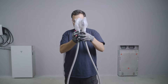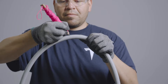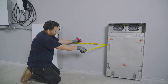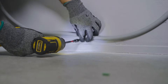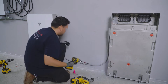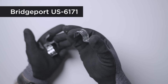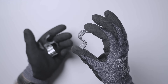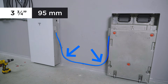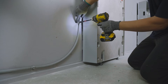For side-by-side mounting installations, make the most symmetrical harness runs by identifying the middle point of the harness and marking it with a pencil or piece of tape. Mark the wall at the center line between the two Powerwall units. Use a one-hole strap to secure the middle point of the harness at the center mark on the wall. Bridgeport US6171 straps included with the expansion unit must be used to strap Powerwall expansion harnesses. Evenly bend the harness on both sides of this strap to create matching bends that comply with the allowable bend radius.